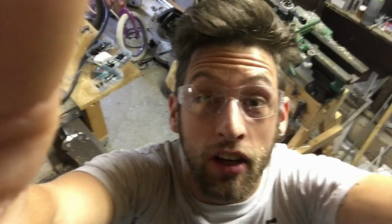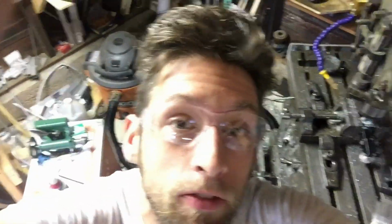That's the y-axis control, the x-axis control, that's the z-axis control, that's the computer control block. I built that thing out of an old G5 enclosure because it's just solid aluminum and it's really good at heat management, and motor controllers, especially stepper motor controllers, which is what I'm using here, tend to produce an awful lot of heat. That way the garage doesn't burn down.